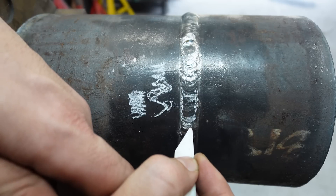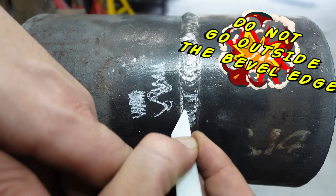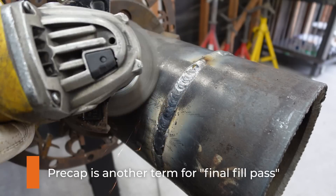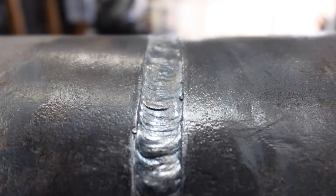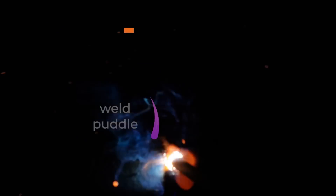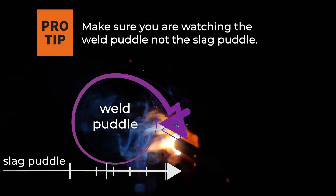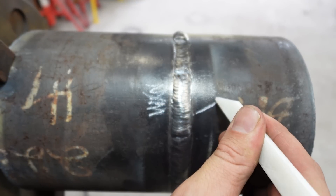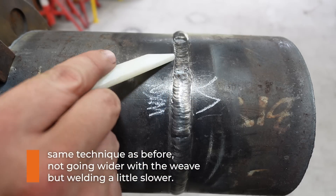Every time you hit one side you've gone across the middle twice, so the middle is going to take care of itself. It's more important that you stay close to the pipe and fill in these edges without getting to the bevel edge. Setting yourself up right on your pre-cap is important for your cap — we're going to be doing the exact same pattern on the cap with just a couple extra details. We are going side to side in this z-weave pattern, pausing on those sides, and not taking too big steps forward. You can go forward more in your pattern — you just don't want to go too wide; you're stuck to the tolerances of these bevels.